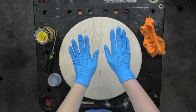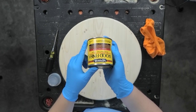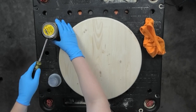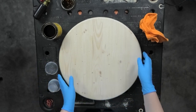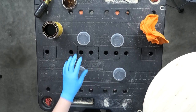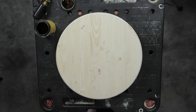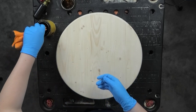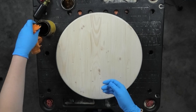When it's time to stain, you always want to make sure that you're wearing nitrile gloves so that you don't stain your hands. I use Minwax stain in the color English Chestnut — that's my absolute favorite. I open the lid to my stain always using a flathead screwdriver. Another thing I found really handy is to use four two-ounce portion cups underneath my sign to prop it up — it makes it a lot easier to stain the sides and allows airflow to help my sign dry really easily. You can find two-ounce portion cups just at the grocery store. I like to use a lint-free rag like an old t-shirt when I stain, bunch it up, dip it in the stain and get it fairly saturated but not so saturated that the cloth is dripping. Then apply the stain in the direction of the wood grain.